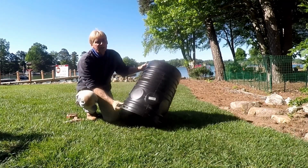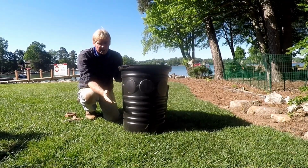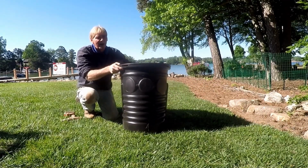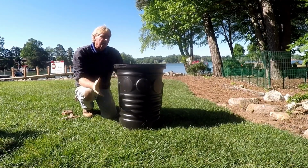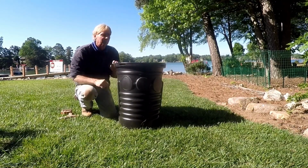This is because it acts like a boat. Water is going to rush in along the side of it, and we want that water to come up through that so the pump can lift it out. Otherwise, it would be like a boat and it will float upwards. So we need to put a few holes in there. This is for the crawl space. In your basement, you're going to pour a floor around it, and the concrete holds it in place.